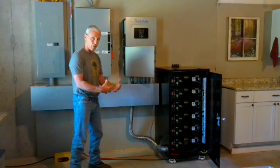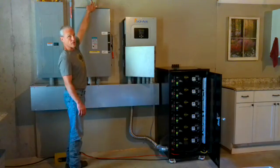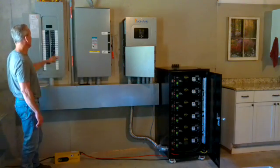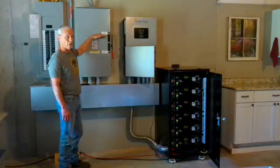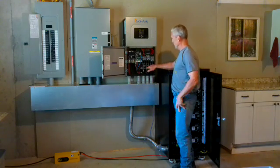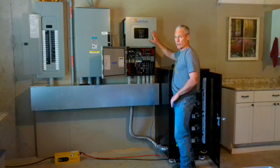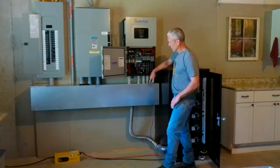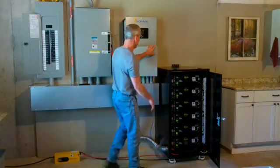Until I'm actually in the real-world scenario, I want to make sure everything's working very well. This would be the grid feed right here that you'd have in a standard house — normally it would come into the top of the breaker panel, just a normal breaker panel like every house would have, and feed all these breakers and send the load onto your house. Our grid connection just sits right there doing absolutely nothing. This is the AC feed coming out of the solar. You've got DC coming in, and then the solar inverts the direct current into alternating current pure sine wave power, sends it through these cables, down through the wireway, through this conduit, and into the breaker panel and through the house.